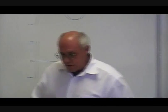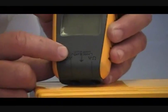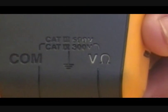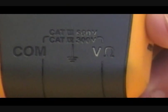But at least have a CAT 3 meter. Now, a little bit of discrepancy is the voltage ratings on the meter. I'm going to see if we can see this on our meters here. You have a CAT 3 at 600 volts, and CAT 4 at 300 volts. When you see that 300 volts, it makes you think that's not that good. But the CAT 4 actually supersedes the safety of the other. Voltage is important, but keep in mind the category is where the real protection is for the individual.